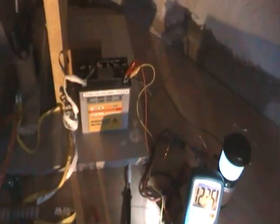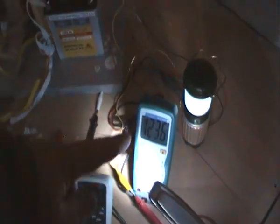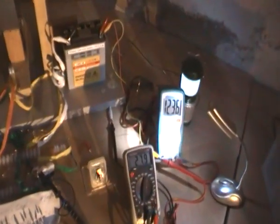But I always charge my primary battery conventionally. I'm taking real power, and I'm paying the power company for it. So this is not an overunity system, because I do not use this energy to run this battery. I'm just getting enough energy to charge the battery. But as a result, my primary battery discharges, and you see this clearly. It started with 12.43 volts, and now it's 12.36. So not an overunity system, but still a very clever and very efficient way to charge your batteries.